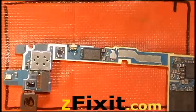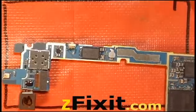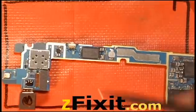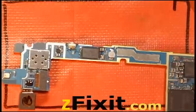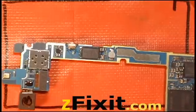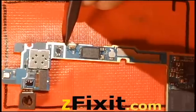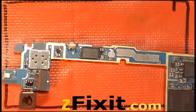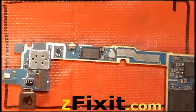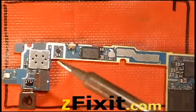Once you're satisfied with the amount of flux, you can cut up some low melt desoldering wire and just place it on the solder points. The low melt wire lowers the melting point of the existing solder. As you touch it with the soldering iron, it will mix with the existing solder and lower the melting point. You place the soldering iron on there to allow the new solder to flow and mix with the existing solder.